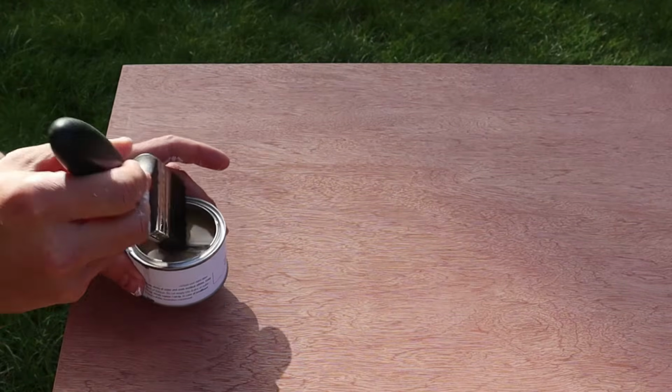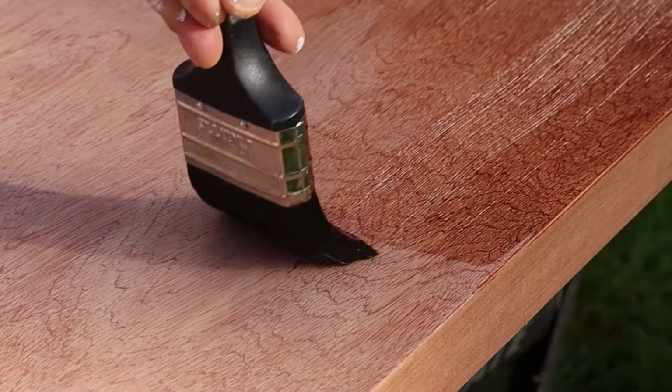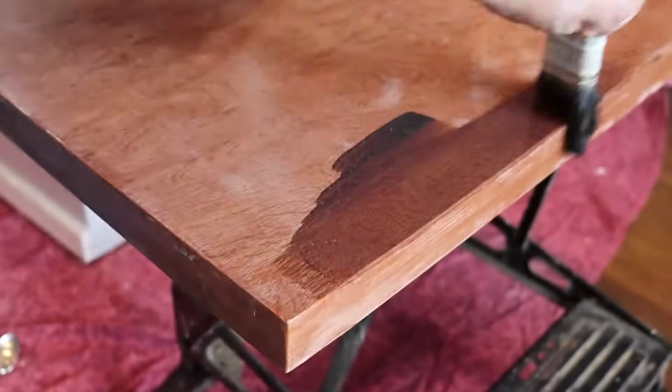So for the lid I used a sanding sealer to stop the stain from soaking in. I use a combined varnish and stain, and you can very easily get brush strokes if you're not careful. So this sealed everything off to give a really nice finish.